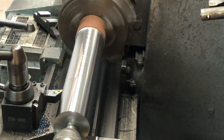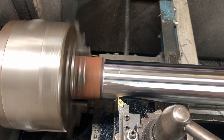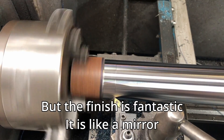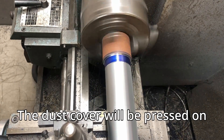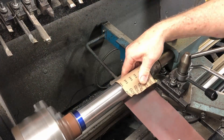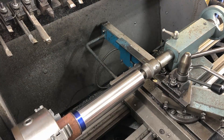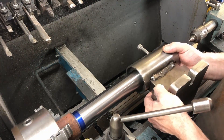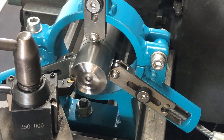We started again and turned the outside diameter down. The chips look blue and they're hot. I'm running the lathe slow, taking light cuts of about 0.2 of a millimeter — that's about 8 thou each pass — to take it down from 50 millimeters to 43 millimeters, so there are a lot of very slow passes. That blue area at the end is the little step for the dust cover. I got down to size, gave it a quick run with some emery tape, and then did a test fit in the body — and that went on pretty good.